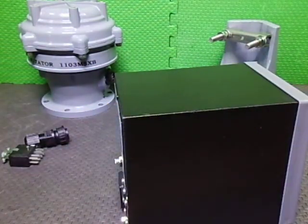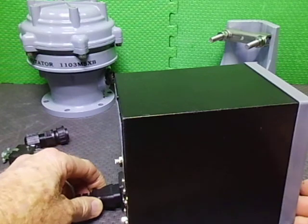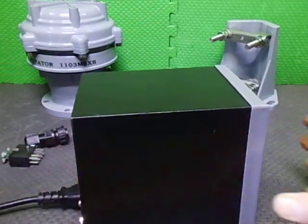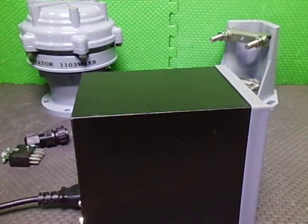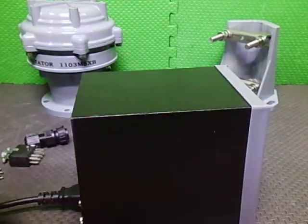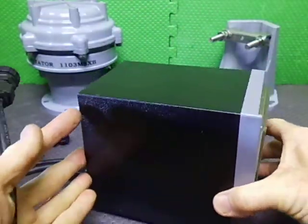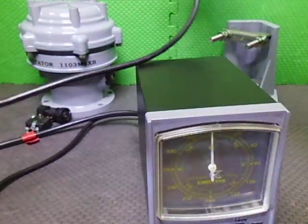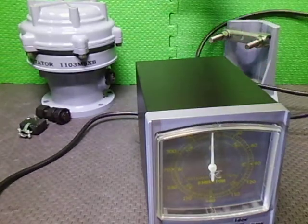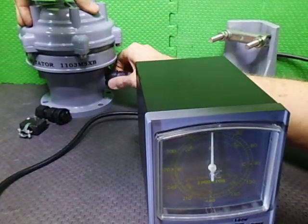So I've already got my power cables and everything sitting here. IEC socket's fused, so we'll plug that into there. Make sure the power is actually off, which it is. Okay, we'll plug our control cable in. Cinch socket, 8 pin. We're only using 7 pins of this one. So basically, swing him around. We'll run the cable back around the other way, and we'll plug him in, locate him up.